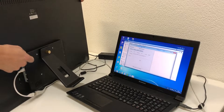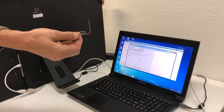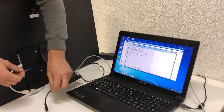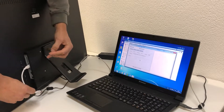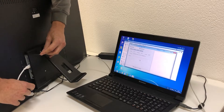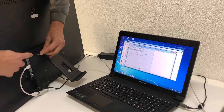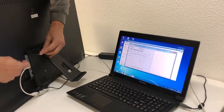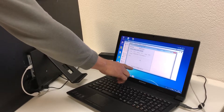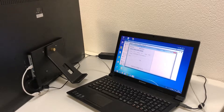There is a small hole at the back side — it's a reset button hole. You need to use a pin; we use a paper clip. Put the paper clip into the hole and press the button you feel inside. Press and hold that button, then plug in the power, keep pressing, and then release it. In the software you will see 'found one loader device,' meaning it now has a connection.